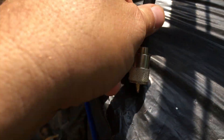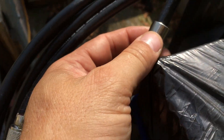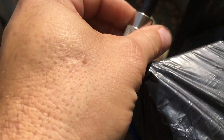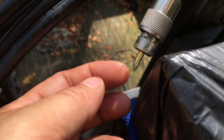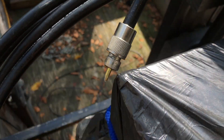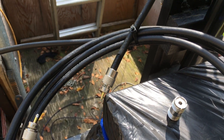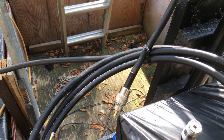That's definitely my problem. That's what happens when you forget and don't do what you're supposed to do. So we're going to back this off and let it dry. Water came gushing out — look at all the water that was sitting inside there. At any rate, we'll let that dry out, redo the SWRs, and see what happens. I'll be back after a bit.